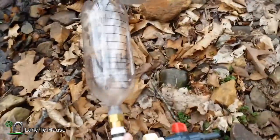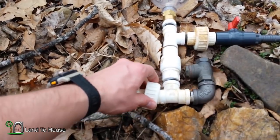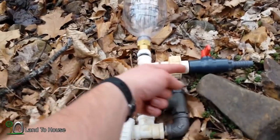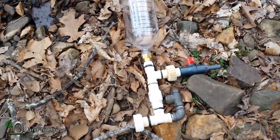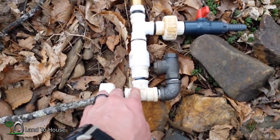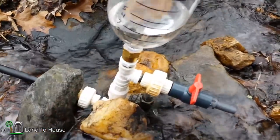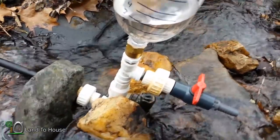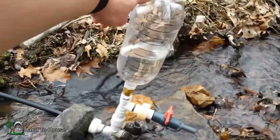Different day, and 40 degrees warmer. I've got a new design — it's just arranging the components a little differently than before. The drive pipe comes in here, this is the waste valve on this side, then it goes pressure up into here and fills the tank. Let me hook this up and give it a test. Okay, it seems to be going — I'll let it sit for a little while and watch it fill up the tank. That design seems to work just fine.